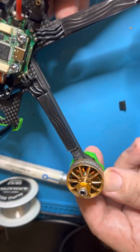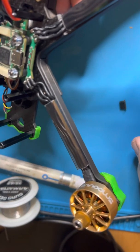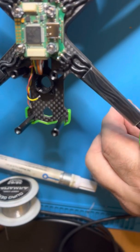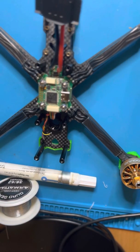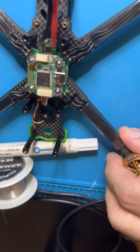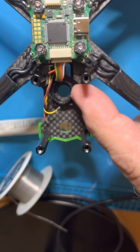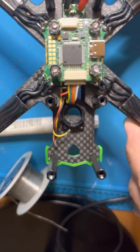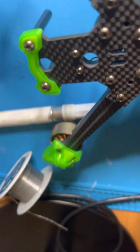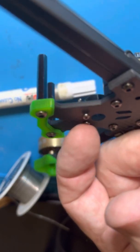Don't forget to run your wires through these guides before you solder. Make sure your wires come in as close as you can get — the side panels are going to push down. Also, the screws in the buzzer mount — I mentioned earlier that they'd be good enough to hold the TPU, but they're not. You're going to have to put nuts on them. They're already trying to come out. Right here you can see that one's backed off just from me assembling it.